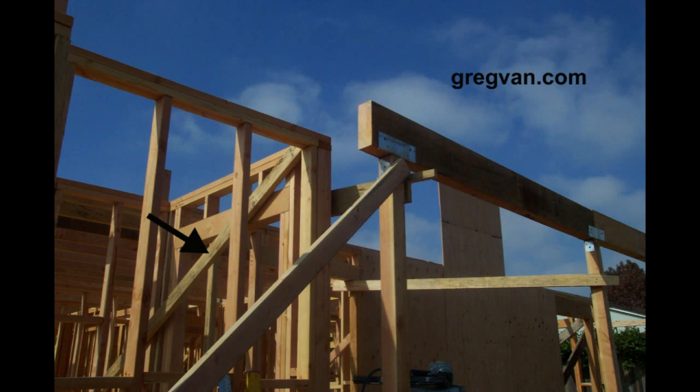It's not sticking up at all. That's the biggest problem with wall braces — and I can't tell you how many times I run into this if I don't put them on myself or am not part of the process. All these things need to do is stick up above the top plates just a little bit to create some problems for the next phase of the construction process.